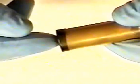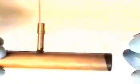Be sure the bending rubber sheath is pulled up and around the end of your vacuum jig. Proceed to the other side. Cut off the excess once you stretch the bending rubber, and again pull the sheath up and over the other end of the vacuum jig. The bending rubber is now fit into the jig and ready to apply onto the endoscope.